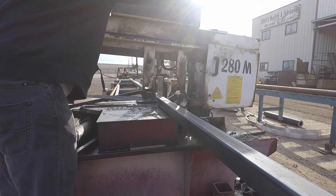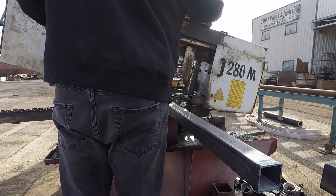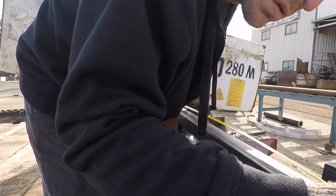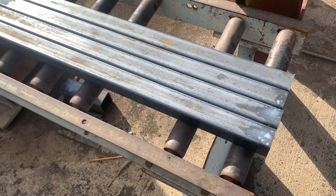At 45 and a half, these four pieces that I'm cutting are 2x2 120-wall square tubing. The square tubing is going to form like the outer portions of each ramp. As I'm cutting and doing all these things here, I'm just trying to take care of myself, not get hurt, and also kind of focus on what I'm doing. That's another reason why I'm doing the voiceover - it is a loud machine shop and I just wanted to do my best to be safe.